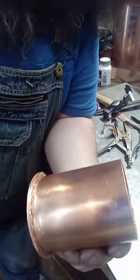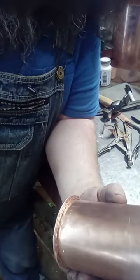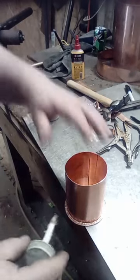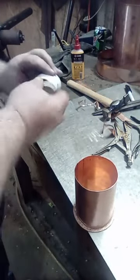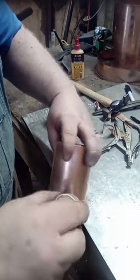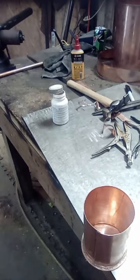You can fold this lip over to where this edge touches the sidewall again, and it will be nearly waterproof without solder - a traditional tin smith or copper smith would have folded that on over quite possibly. Now we're going to solder. Flux first. How much flux do you need? Really, just cover it with a thin layer with this kind of flux.